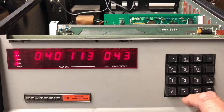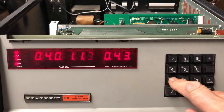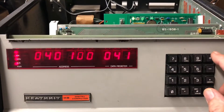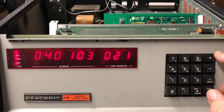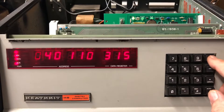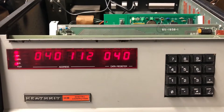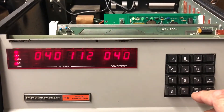To look at the memory test routine, we're going to go to memory 040100 and just start examining. And it's still there — I recognize these bytes. Here's the 377 to the top of RAM. So that's really sweet. It's been a week and that battery backed up memory has held a little memory test program in place.